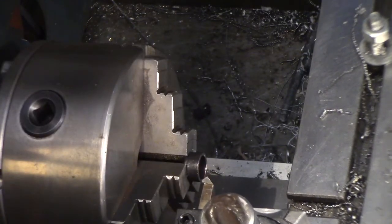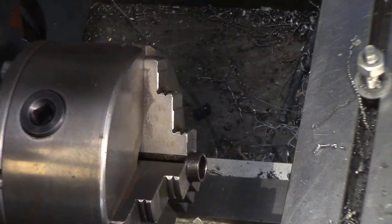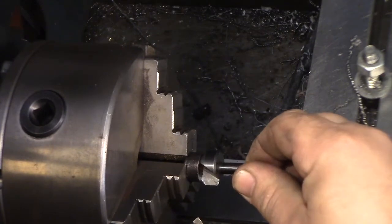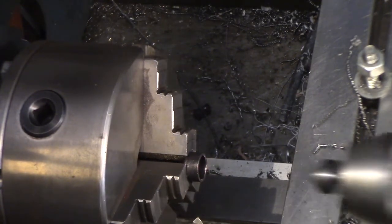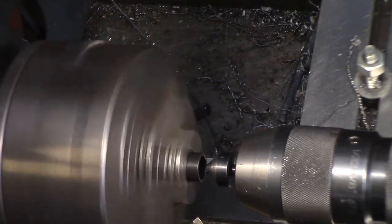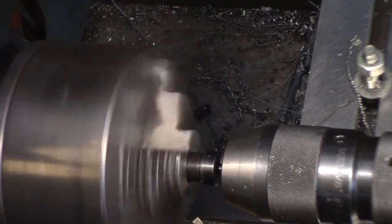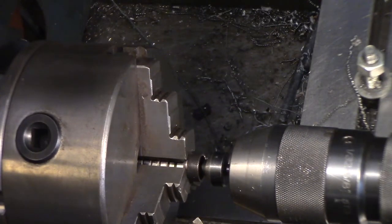I probably am better off trying a chamfer tool because it'll put equal pressure to the back side of the chuck. Maybe that will be sufficient. So we'll try a single cutter first to get the smoothest chamfer on there. And if that doesn't work, we've got the multi-tooth, multi-edge style that tends to chowder things up. Let's grab chuck. Need one of those. Nope, that does not work at all. But I might have got just enough chamfer. Let's take a peek.